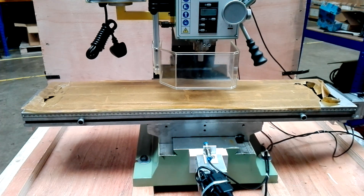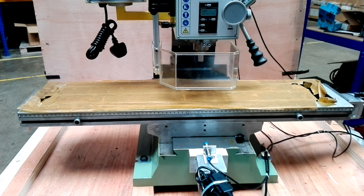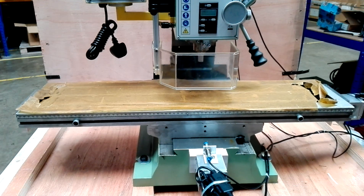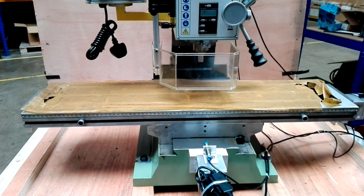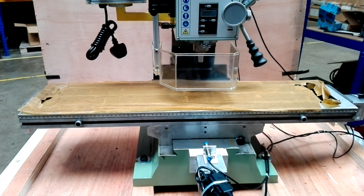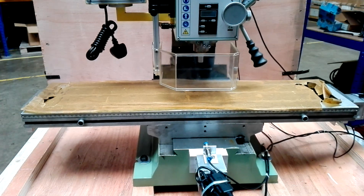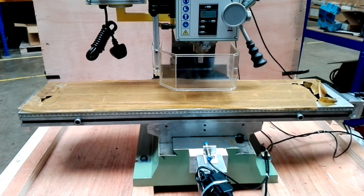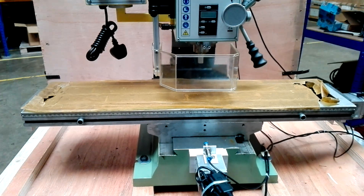This is just cutting down approximately about a 19mm hole going around there. We'll just speed it up a bit so you can see it. Not that you'd more likely be cutting at this speed, but this is at 200%, which is running at about 1500mm a minute.